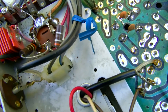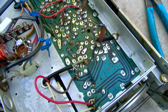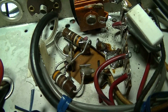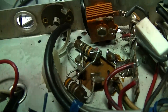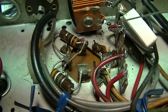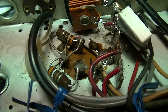We've got two 390-ohm resistors here, and I picked those up in case the owner wants to replace the capacitors — I don't know if I'd recommend it yet. We're going to test it for a few days and see. The owner said this is a no-expense-spared repair, so I've completely cut the capacitor out, isolated it on its own, and moved the three B+ wires up here with two new 390-ohm resistors. We're going to recap it.